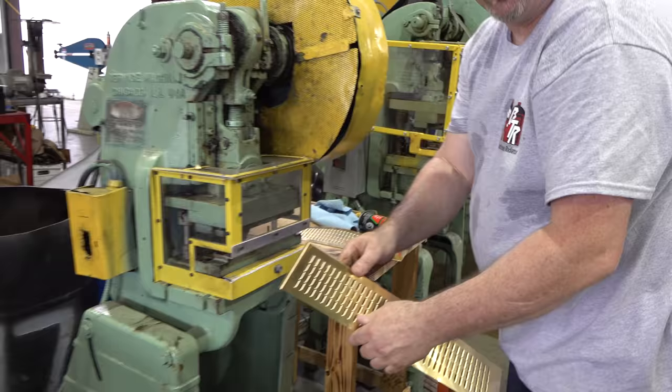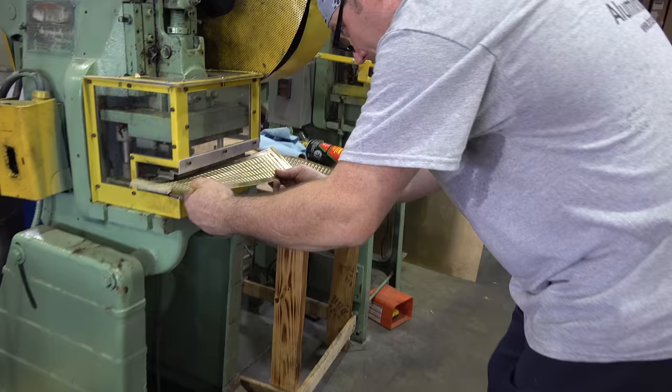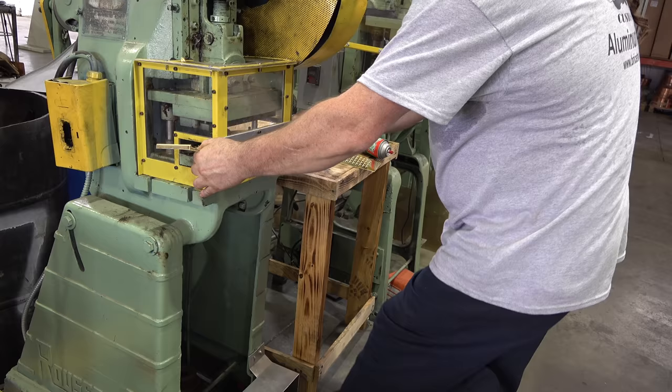Wade will take that header and form the drop seam in it, put the radius in it, so that when the original tanks go back on this core the stamped tanks have radius corners — that way everything fits down in that channel real nice and we get a good solid braze-solder joint. The solder is actually coming around the backside, kind of doubling that joint up.